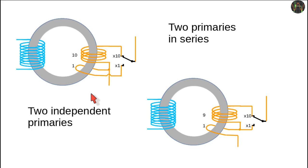The drawback is that you have to get both 1 and 10 windings through the core. In the series wiring on the right, we must use one winding less because the current always flows through the x1 winding coil, and if the switch is in the x10 position, there are 9 additional windings added for a total of 10. If this wiring is chosen, it is crucial to pay attention to the winding orientation. The x1 winding and 9-winding must have the same orientation — the 9 wires must continue going around the core in the same way as the 1 winding. If you change direction, the windings will not add up to 10 but 8, because the magnetic fields cancel each other. The tricky thing about getting the number or orientation of the windings wrong is that the meter still works — it just shows the wrong values.